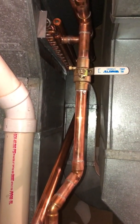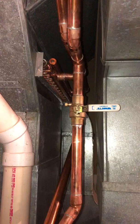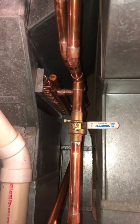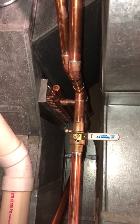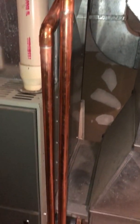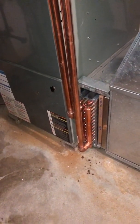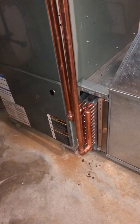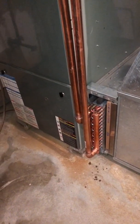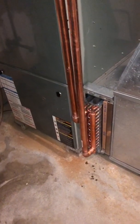One thing you got to be concerned with is, especially the Thermopex, their 1 inch rated line is actually less than 1 inch. So when you do your flow calculations, you want to make sure you get enough flow over to your exchangers in the house. And depending on your distance and the flow you want to achieve, you might have to upsize the lines. But that's an important thing to look into, because once you've spent money on those lines, it can be anywhere from $12 to $15 a foot. Not to mention renting a mini excavator or having somebody put that line in for you. You want to do it right the first time.